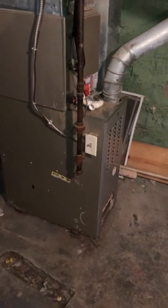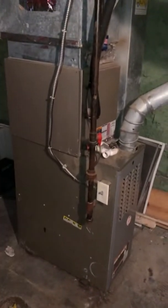Hey guys, here we are in the city. This is the furnace the air conditioner is going to replace, going back with a 60,000 BTU unit. The first thing: on the flue pipe, he does not have a chimney liner, so we're gonna have to put a liner inside of this chimney here.